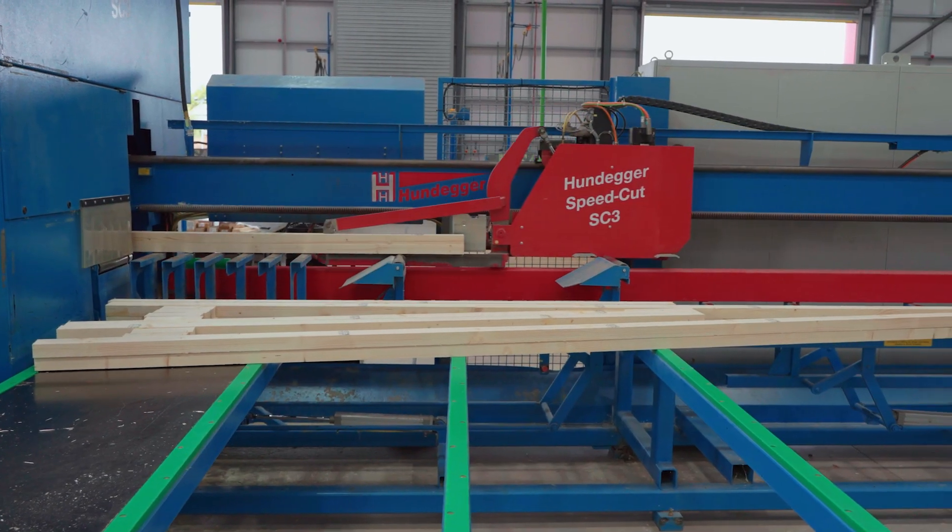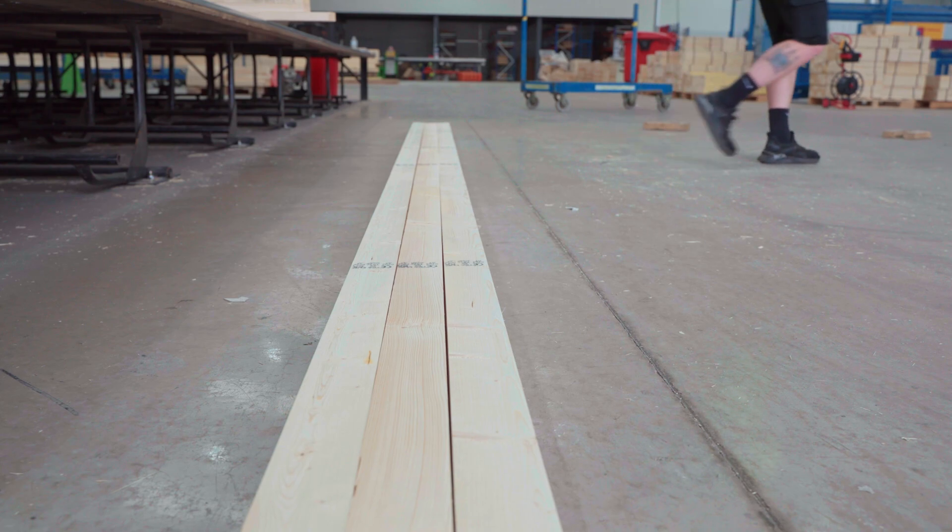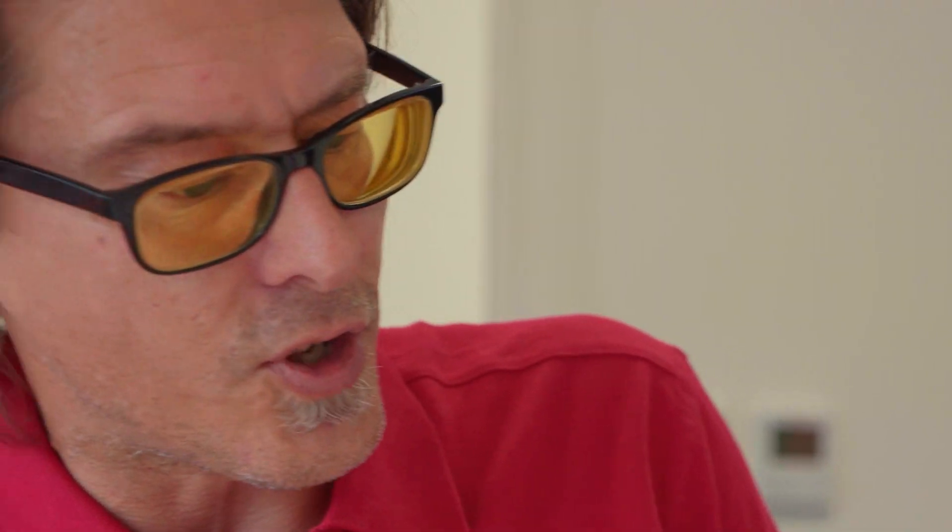With a truss you're using a lot less timber than you would normally. With a cut roof you're looking at what we call singularly supported items — a pair of rafters, a ridge beam, and a separate floor joist, all individual elements. In the truss, all three are combined together. We use triangulation to always take the load path back down to the wall plates, which is where we've got foundation and support.